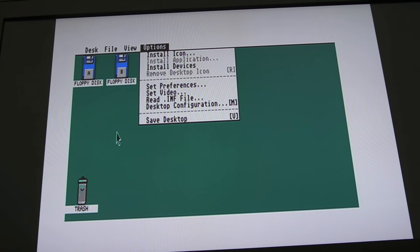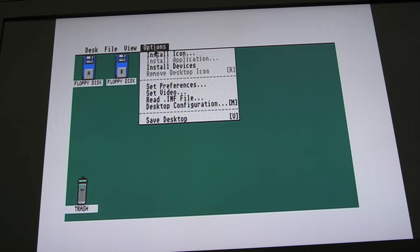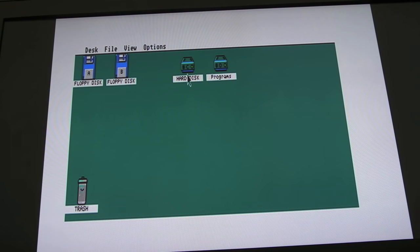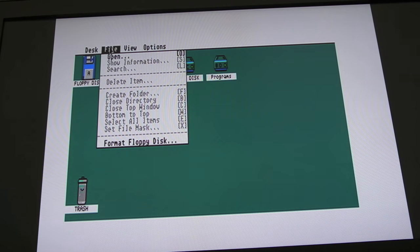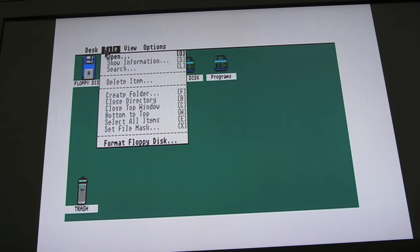The blitter is only 24-bit — it can't operate with RAM in the 32-bit address range, i.e. the TT RAM. The net result is instability — totally unstable when you use the blitter. The way you get around that is to install NVDI. So if you're lucky enough to get a Falcon and a CT60, installing NVDI is one of the very first things you do. I also installed some of the control panel stuff — that's where this temperature thing came from — it's not there by default.